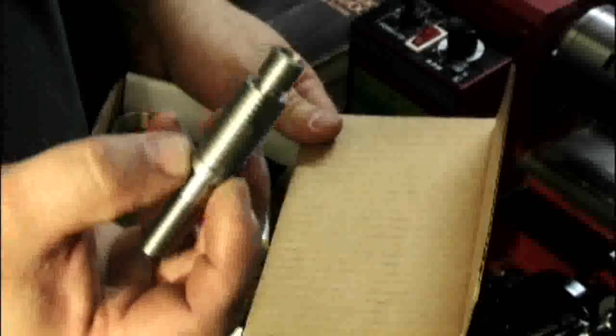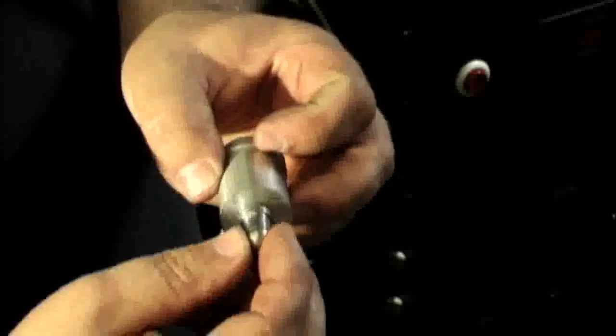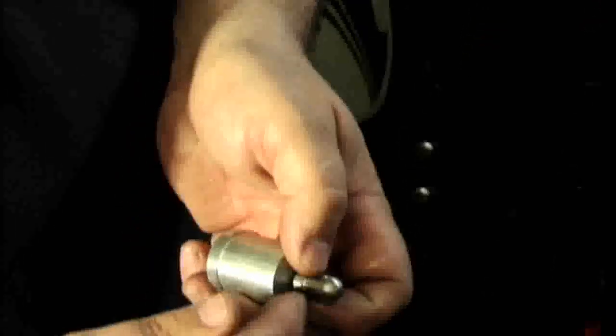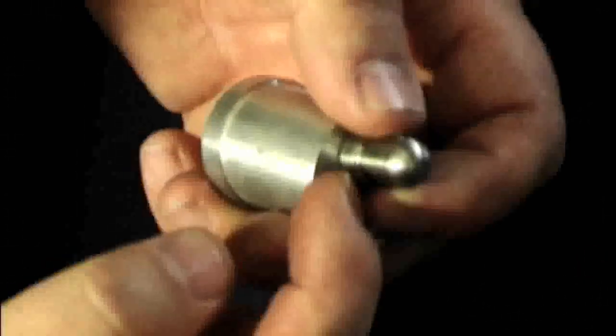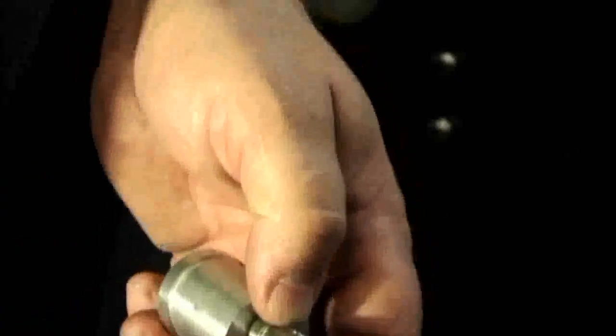Let's give an idea of what's a good beginner's piece, because everybody's excited about buying one of these little mini lathes. You'd machine down on the end like here — you come back, you cut it down, you rough it — and then you make your step. You cut this diameter, cut up to this step, come around and do this radius, come in and put the groove in, and then use a cutoff tool.